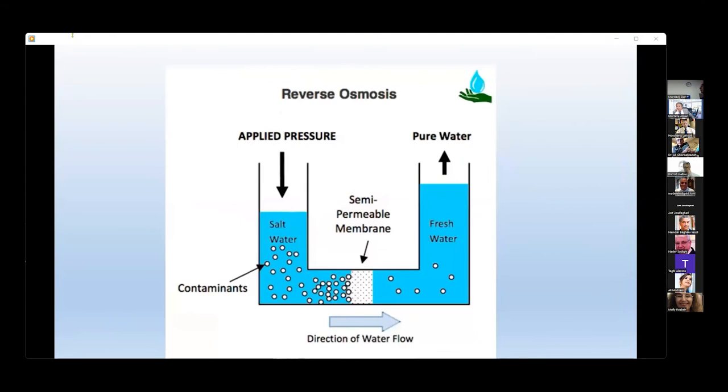This is a reverse osmosis system that is used in several parts of the world to solve the problem of water purification. The largest is in Israel with a capacity of about 228 million cubic meters of Mediterranean seawater treatment per year, followed by Bahrain with a capacity of about 200 million cubic meters treatment of the Persian Gulf seawater per year. Notice in the picture, seawater enters the filter with high pressure. As a result, the majority of salt from seawater is absorbed by the filter. But some salt passes through the filter, hence the treated water is not as pure as the previous system. Unfortunately, treated water has impurities.